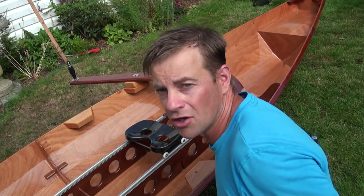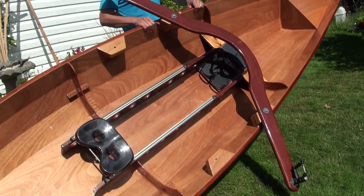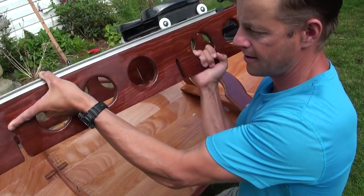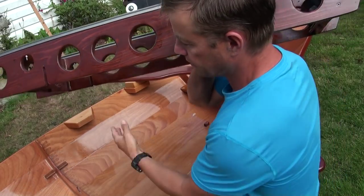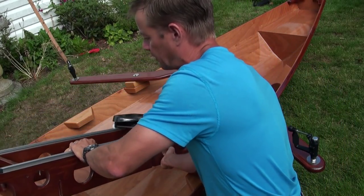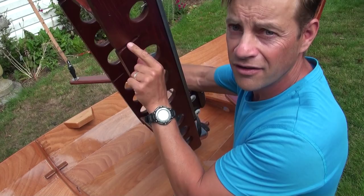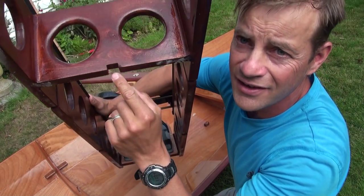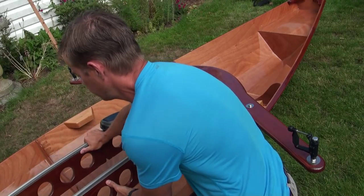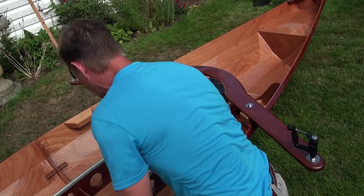Our system affixes very securely to the boat, which is essential when you're bouncing around in big waves, and it's a pretty simple way to do it. The sliding seat unit just lifts out and you can see there are little slots in it which slot into the frame. We actually have this one set for two different positions on this boat for trim — when you have a passenger and when you don't. There are corresponding cutouts and little notches, and we've created small blocks epoxied to the boat. It just slots into those and creates a very secure and firm mount — and boom, it's ready.